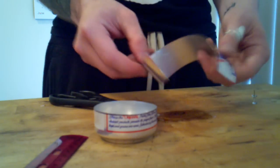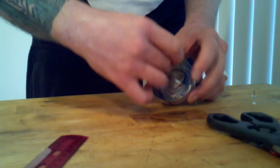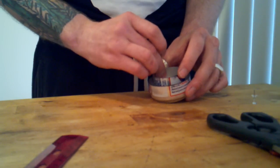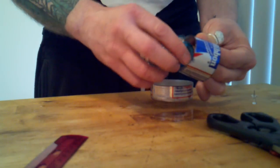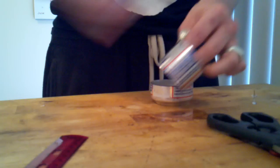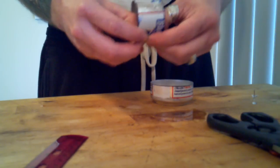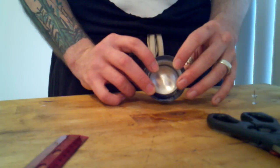What you're going to do is take your middle piece and coil it up and fit it inside this ring, get it to about the right size, and then put a couple of staples in it. I usually staple from the inside — that makes nice smooth lines on the inside with nothing to catch on anything. You'll end up with something that looks like that, and it should fit nice and cleanly right into that inner ring at the base of your stove.